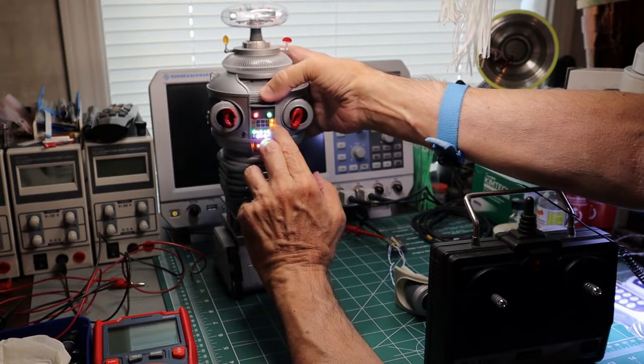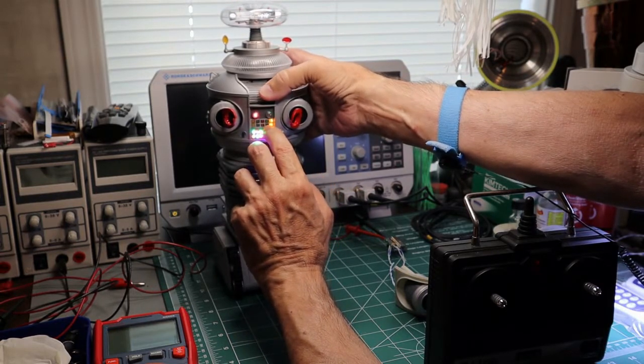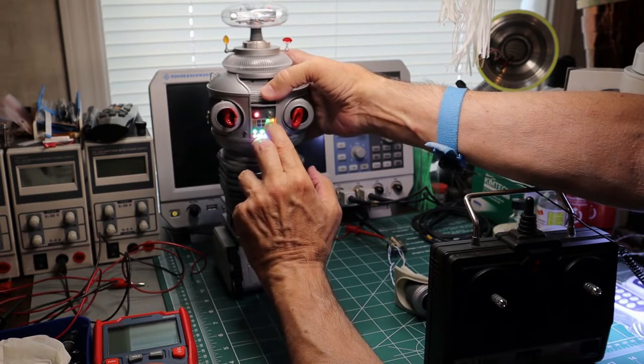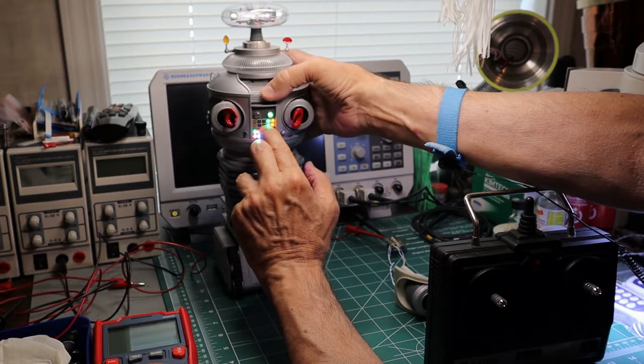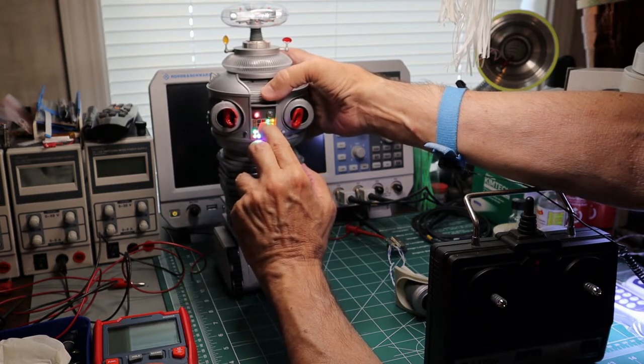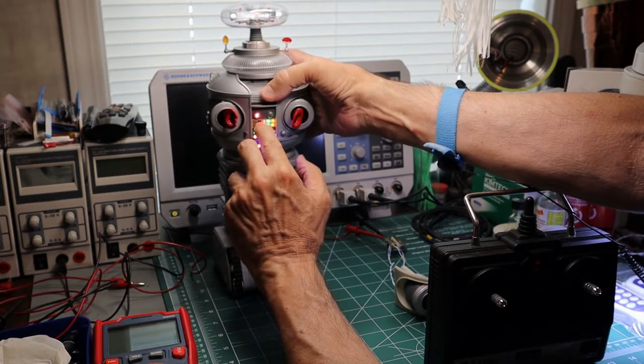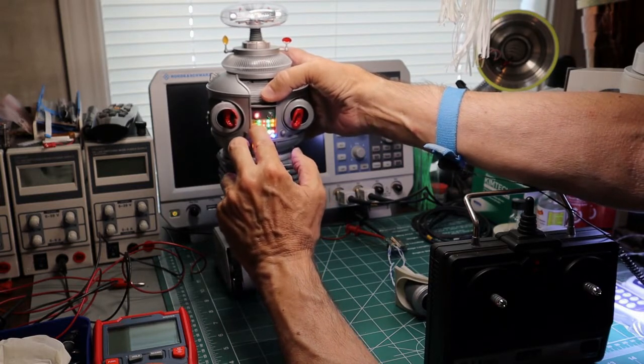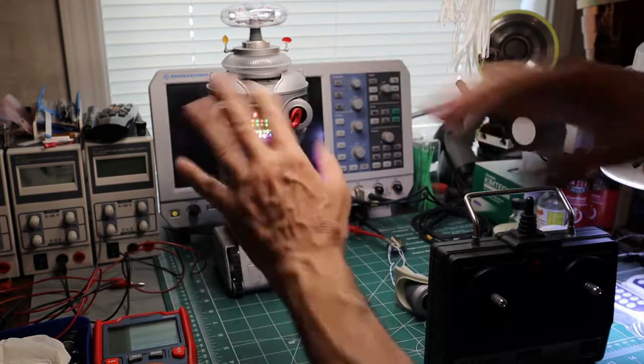I've got a chip that — you can see there — there needs to be what's called a debounce. I kind of got cheeky and decided just to use a very simple flip-flop without any debounce, so that's kind of annoying.